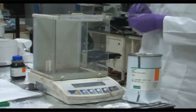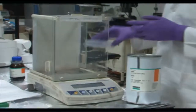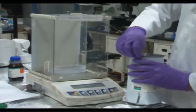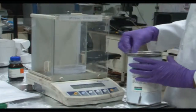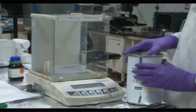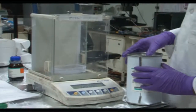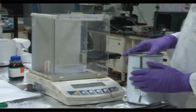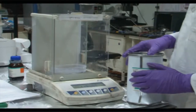So you use that same process of measuring by weight, and there is a mold box, again a sacrificial mold box being used, and you will be using this commercial brand available for PDMS by mixing two phases, which is the resin matrix along with the curing agent, okay, and this would be in a ratio of 10:1 by weight, so that you can have proper functionality like curing time, etc.